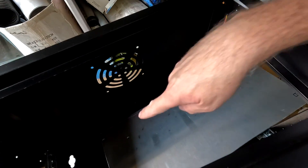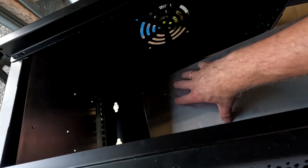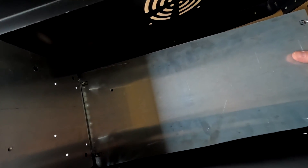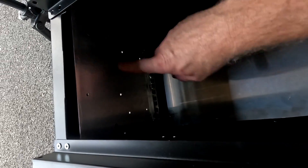I really had to take out all these components again. I could leave the plate in but I need to do measurements and fasten the screws in this back bracket first, otherwise I can't reach them once the components are mounted. I totally screwed up today — I should have started with the backplate first and then done the power supply plate, but the power supply was more interesting with all the components and the backplate is just a plain aluminium plate. Anyway, it's done now. I've drilled the holes, put the cage nuts in, and now I can redo all the components.